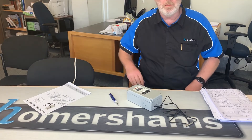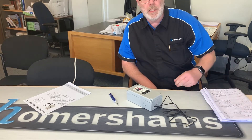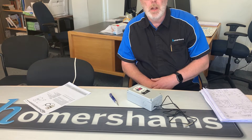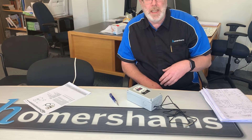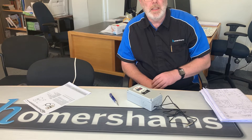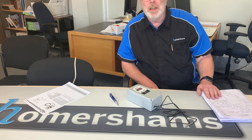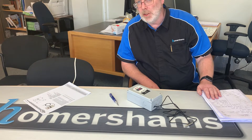Here at Homershams we often get asked for temperature control devices, and many a time I've talked to a customer who's wanted to heat above normal temperatures. For example, our standard Honeywell domestic thermostats top out around 30 degrees, for the very good reason that human beings don't survive long above that temperature. So no matter how many extra heaters you add, you will never get to a set point higher than about 30.